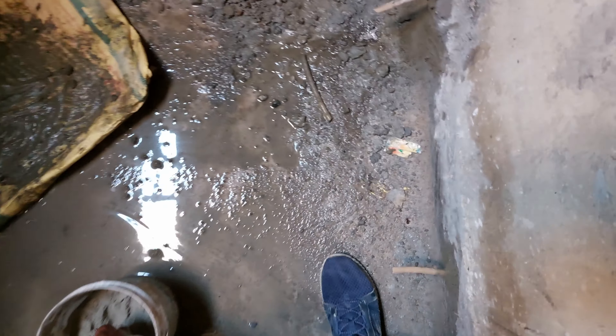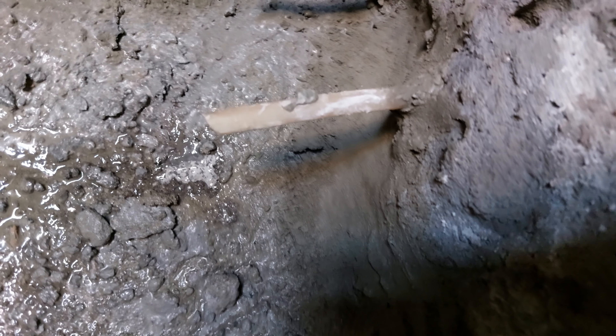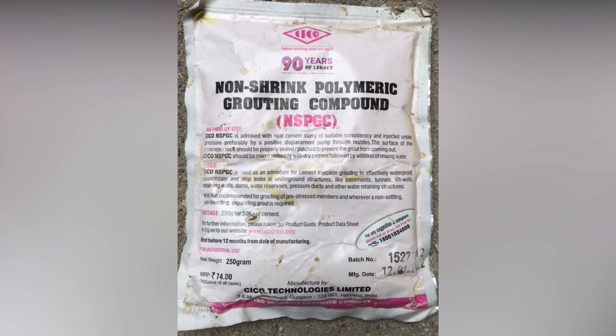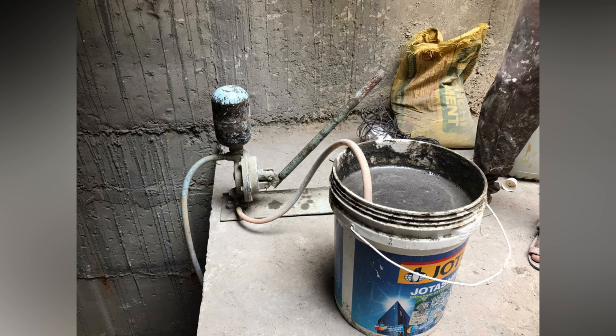Then if water starts to drip from the pipes, it means you are going right. So these spots and the area around all these spots will be filled by grouting of this cementitious material. In order to fill these pores, we need to fix 250g non-shrink polymeric grouting compound in a 50kg cement bag — this will be our mixing ratio. Then we need to mix water to make a slurry, a thick viscous liquid, which will be pumped into pipes with pressure so that it reaches the spots and the area around it will be filled.